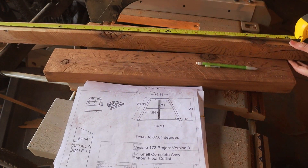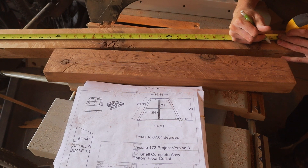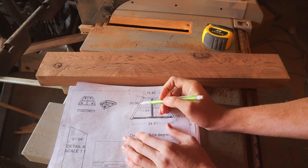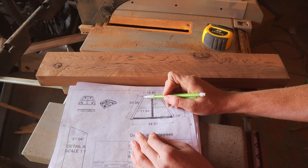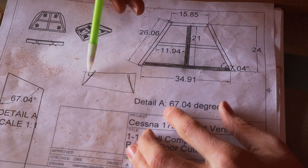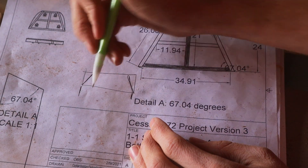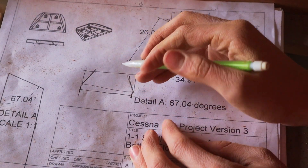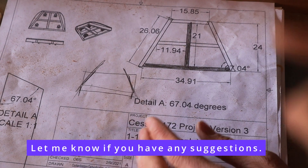As for 34 inches, we can cut a piece off of here — 34.9, that's a little less than 35. I'm cutting these all without angles except for this piece. I need to take special care to add a little bit more because I did the drawing wrong. So on all of my plans, I'm basically going to make it so that you cut this distance and then go back with your angle and cut your angle off. I think that's just the most intuitive and easiest.